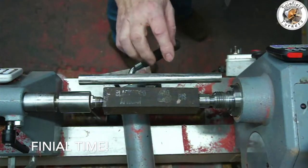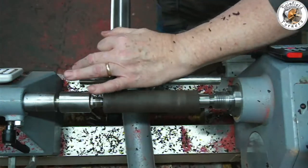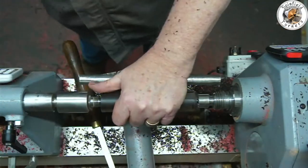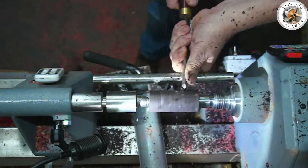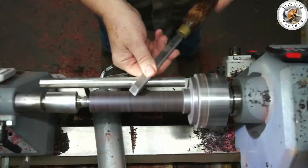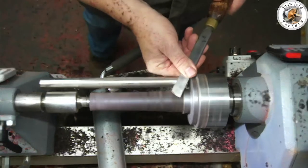I've got some African blackwood which I've put between centres to round off and cut a small tenon with medium-sized Record Power chuck jaws. The blank is only just big enough to allow me to put the tenon on and still have some support on the face of the jaws. I decided to turn both pieces of blackwood at the same time to save messing about with the chuck jaws. I'm going to try a Cindy Drozda-style finial, which requires me to reduce the diameter of the main body for the central onion bowl to smaller than the base.